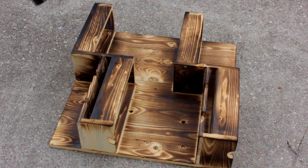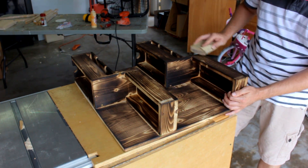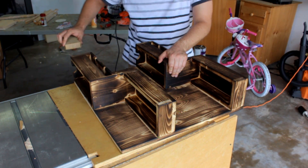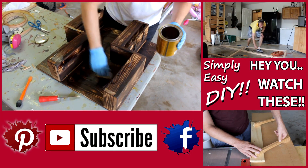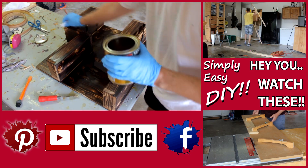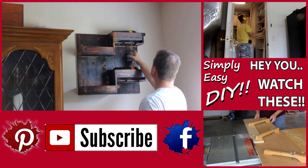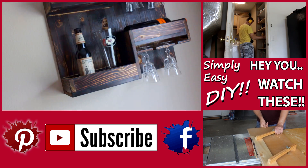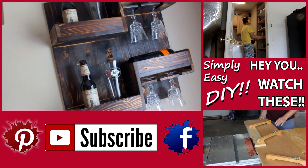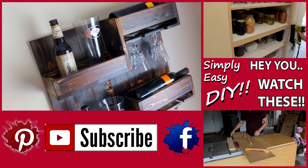From here I'll take it back to my workstation and sand off some of that char, which also helps to even out some of the color. After a couple of coats of wood sealer, I used a keyhole bit to route a couple of mounting spots for some drywall hangers. Now she's ready to adorn the dining room with grace and style. Don't forget to find me on Facebook and Pinterest, and since you made it this far, drop me a like or a dislike and subscribe so you never miss a new project video.